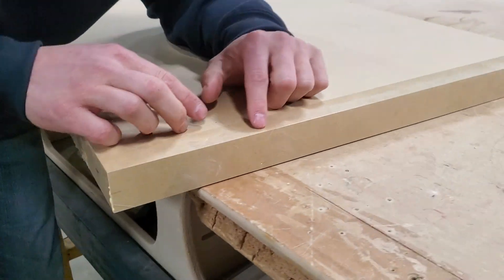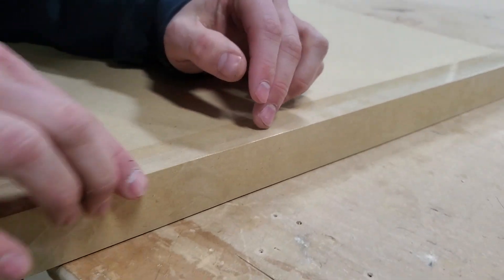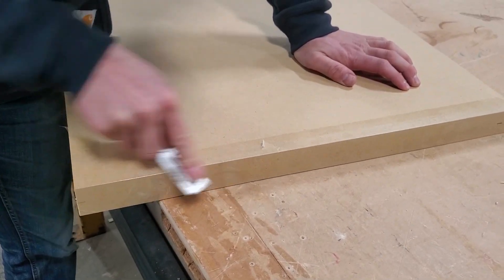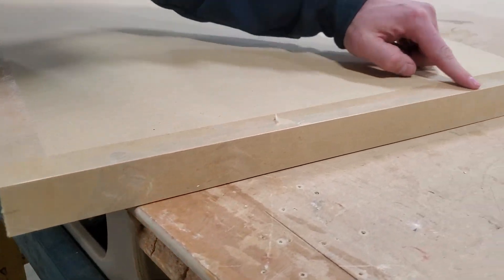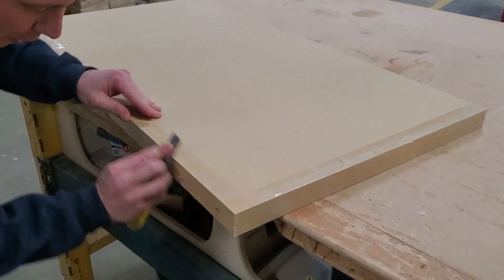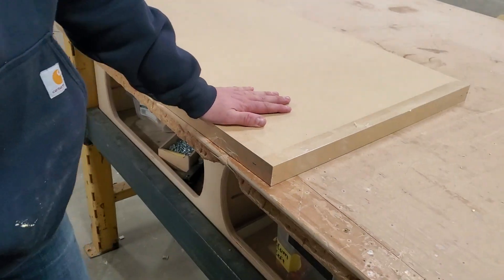You can see how we experienced no glue squeeze out on this mitered edge — we left about 12 thousandths of material underneath the v-bit. We've done this on wood grain quite a bit, and if you take a metal tool with some rounded edges on one side, you can kind of massage this and roll the wood fibers over. This miter had a cut in it so we got some glue squeeze out, but you can imagine if you had wood grain on here how bad it would be to have to sand off a whole bunch of smeared glue. By having that 12 thousandths of an inch, not only does it allow everything to fold really nicely, but it prevents the glue from squeezing out, which is super important on wood grains where you just don't have a whole lot of thickness to work with.